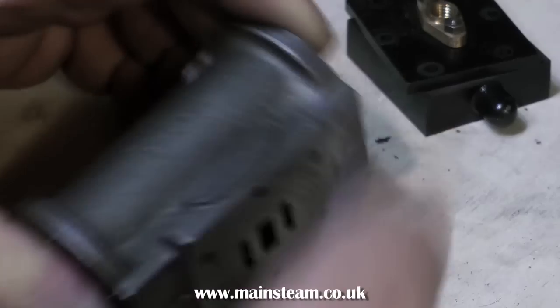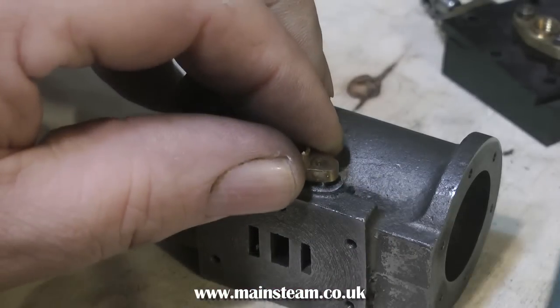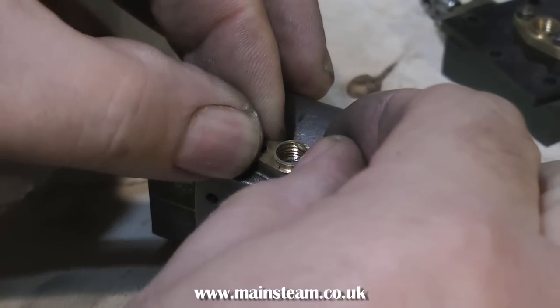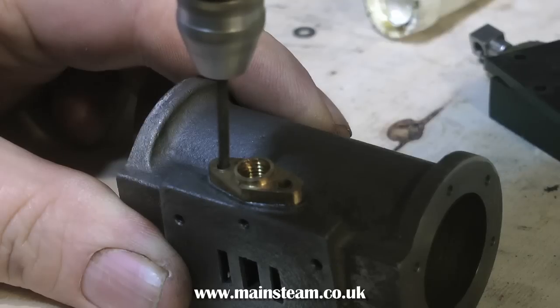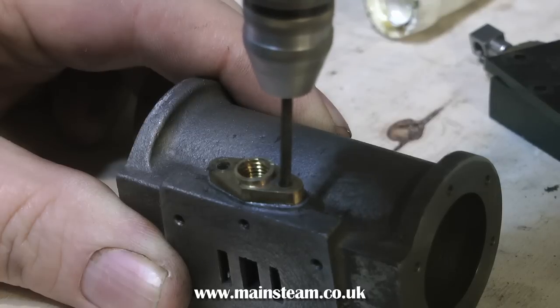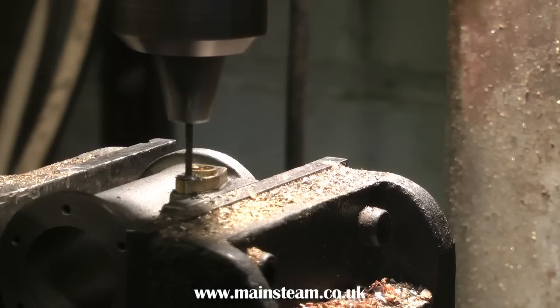Because I'm making a replacement cylinder for an existing engine, I'm using the gunmetal exhaust flange to mark out the casting for drilling. Again I'm using the Loctite principle — just stick it to the casting. When the Loctite's gone off, make slight indentations in the casting, then transfer to the drilling machine and drill all the way down. Again use the depth stop.